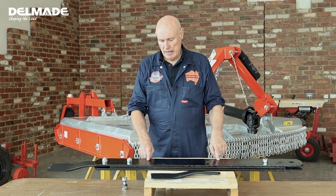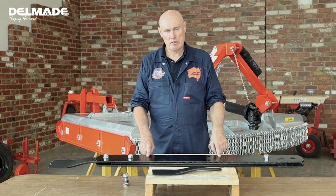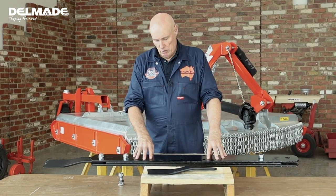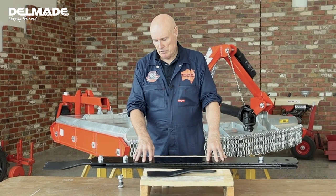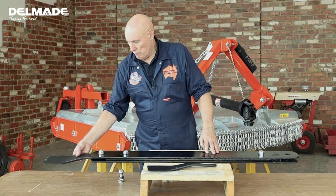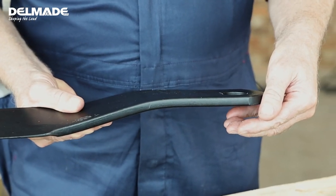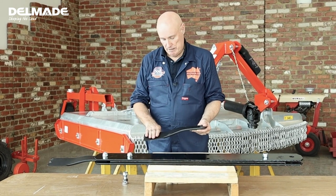This is the EHD and EHD E series blade beam — the core of the cutting performance of these slashers. It features three leaves of alloy spring steel which is hardened, of the order of three to four times the strength of mild steel. The blades on the end are forged and feature both a step-down which keeps the blade head fixing, plus an uplift component to ensure a clean cut.